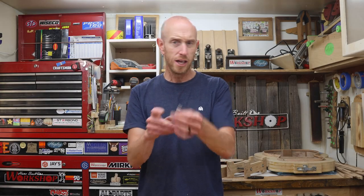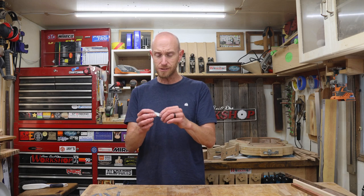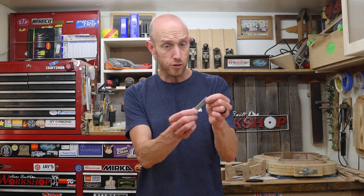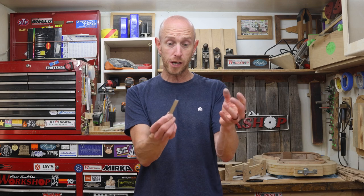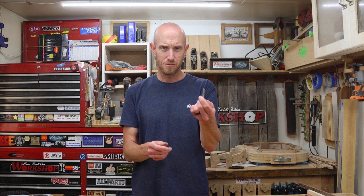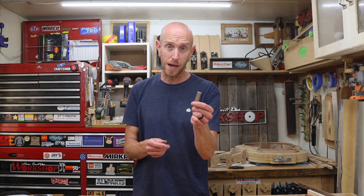You may be wondering why I made six of these little blades. My goal for this video is to make three different finger planes each with a different bed angle, and experiment with whether a lower or higher angle works better for different species of wood. The reason I made six is because I'm not 100% sure of the material composition of this metal. I believe it is some sort of high carbon steel, but I'll need to heat treat these for them to keep a good edge, so I made extras in case something goes wrong during hardening.